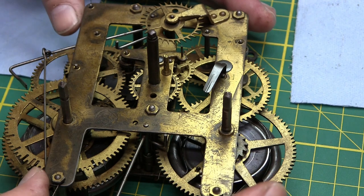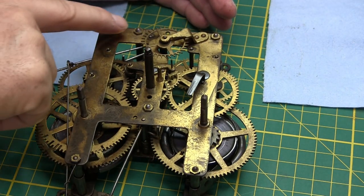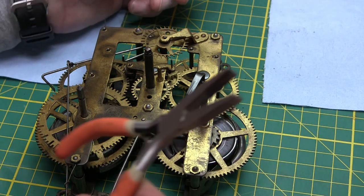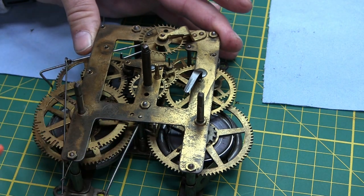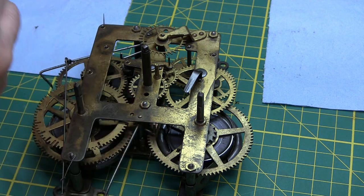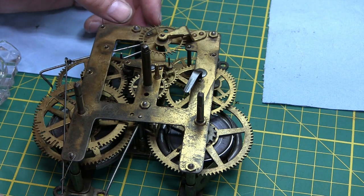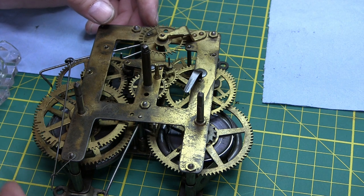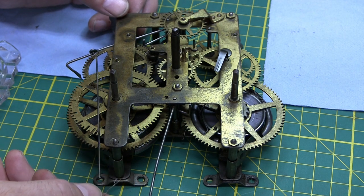Now the time has come to take off the pillar nuts. Pillar nuts are the nuts here which hold the movement plate onto the posts — usually there's four, but this one has five. I'm going to use my flat-nose pliers because one of these nuts is a different size. This one is loose so you can just spin it. Nuts are easy to lose, so I'll put them in here. This count wheel advance rod has a little wire that goes around it — I want to make note of that — and then just slide it off.